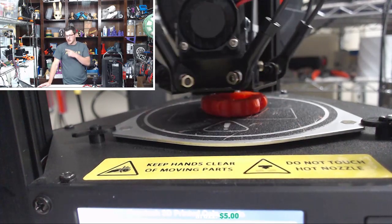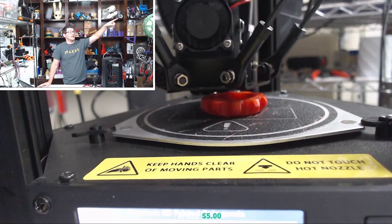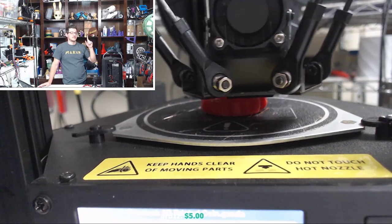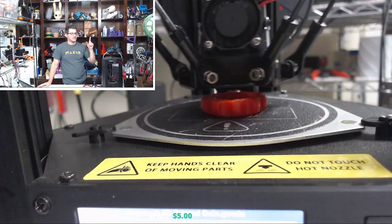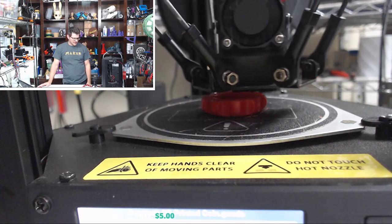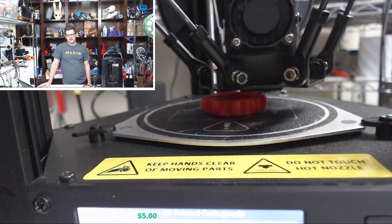Because even with a silicone heater sock on that one, I'm up to, that one's set to 75 on the K280, but it moves too much. The Anycubic Kossel, I can do that one at like 80 to 90 millimeters a second, and it just cooks. But sometimes it has a little problem melting the plastic, so I need to put some Teflon tape and some kind of shielding on that V5 clone that they have on there. I don't know why they like using that V5 clone so much. They probably just bought a butt ton of them back when the V5 was big, and they're still going through the stock. But yeah, I need to insulate the hot end on that machine.